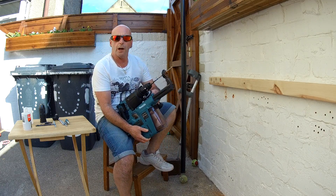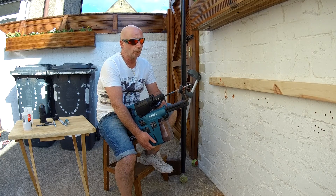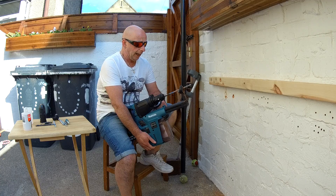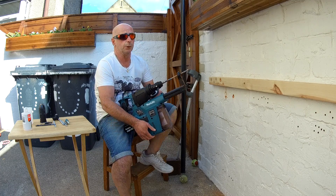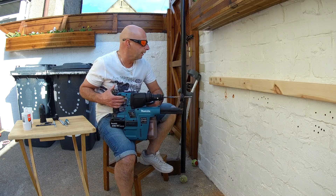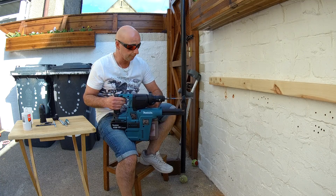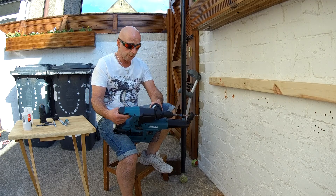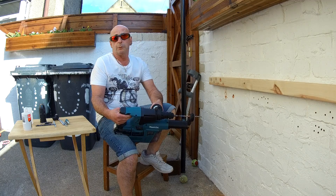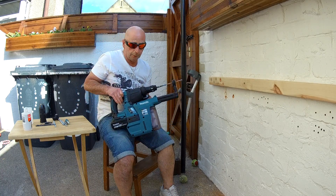As you can see, the fan runs for an additional — it says 3 seconds, it's more like 2.5 seconds, but I'm not going to argue. So the fan does run on for a bit once you take your finger off the trigger. The trigger itself is actually quite variable and very good. They say with SDS drills you're supposed to start them off in hammer mode first before you hit the surface — nobody ever does, so that's a problem with that.